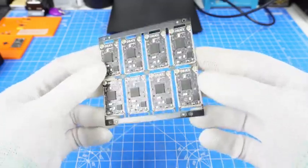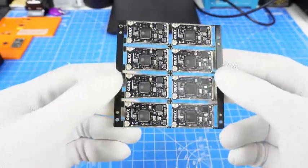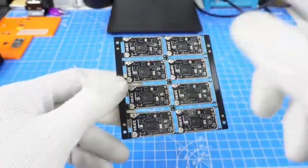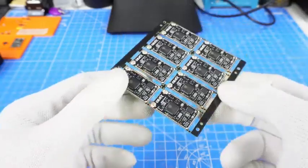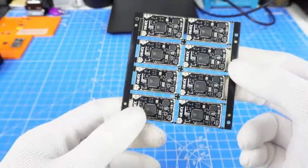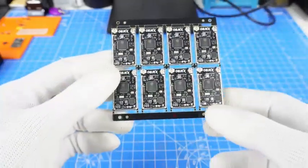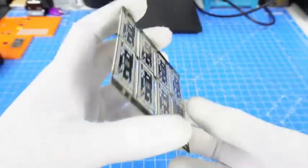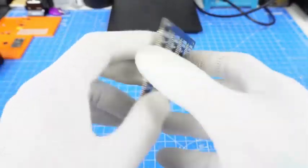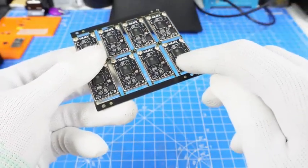The panel is soldered and I'm very satisfied. The pick and place machine did make some mistakes placing some components — mainly 0201 resistors and capacitors. With larger components it generally doesn't make mistakes after proper calibration. This is actually the second panel I've tested and I've improved things regarding the soldering. The pick and place machine also misplaced an RTC at one point — it was in the corner — but I fixed it.